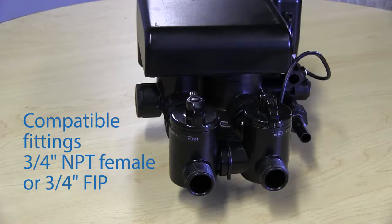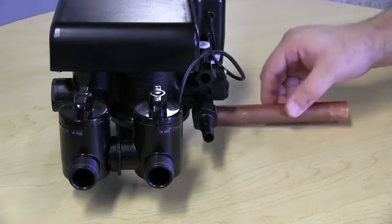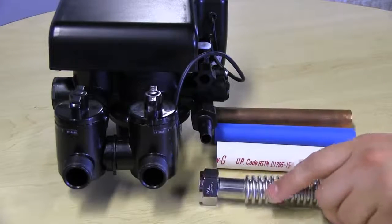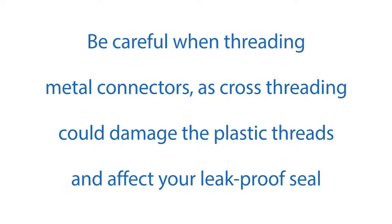The best choice of fitting to connect your home's plumbing will depend on the material of your pipes and the location of your water inlet and outlet. Your plumbing may be copper, PEX, or PVC. When connecting to this plumbing, we recommend using a flex connector because it is less likely to result in cross-threading and allows for height and width adjustments without having to move any permanent plumbing.